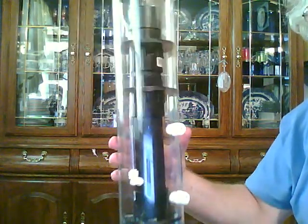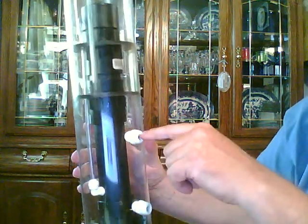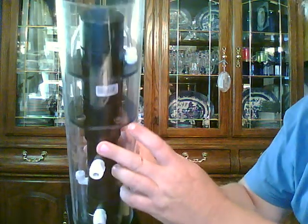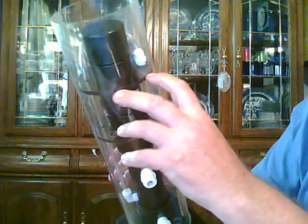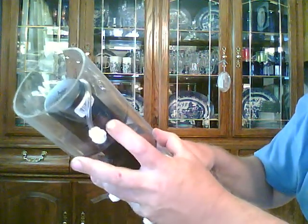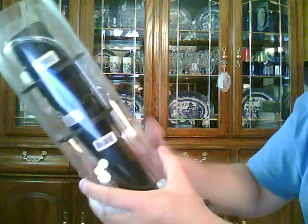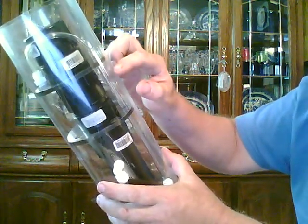The idea is electrolyte will be in here, gas from the cell will go in here at the waterline, and the holes will allow gas to travel up again into this chamber. Since there are no holes in the top chamber except this particular outlet, the gas will flow up, down the tube, into the secondary bubbler.